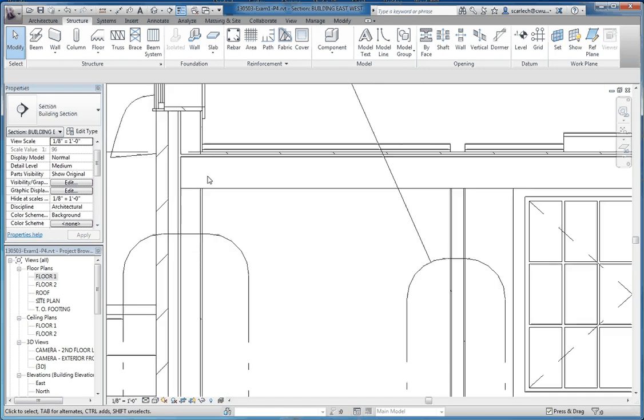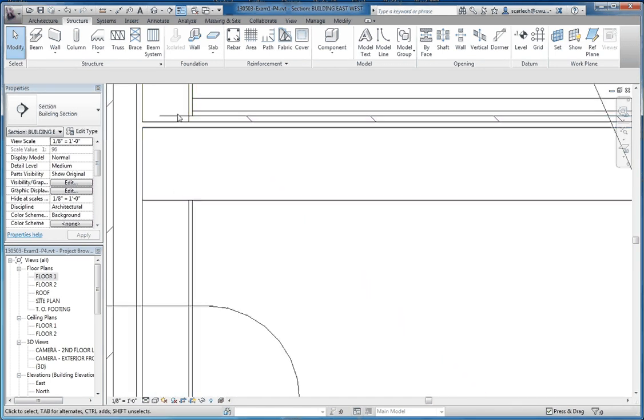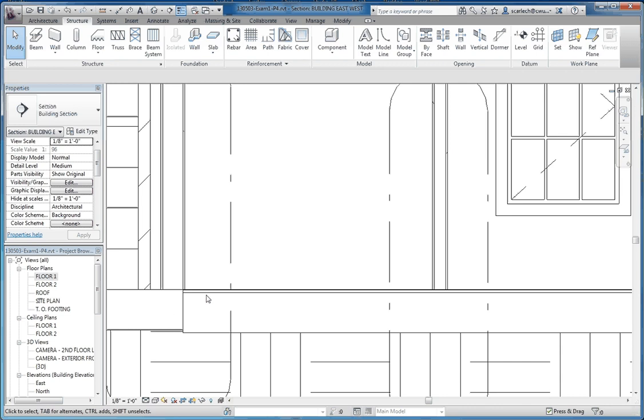This is a little bit different from our second floor. The second floor actually cuts into that wall, which is appropriate up there. There are a couple different ways you can do it down here too. You can have that floor extend out to the edge, but I think it's better to have it supported. These are first floor walls supported by the stem wall and foundation walls. There are other variations where the floor — the horizontal structure, the plywood — could come out and be sandwiched between the structural walls for the first floor and the foundation, but we're not going to do that. We're just going to put our foundation wall underneath.